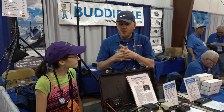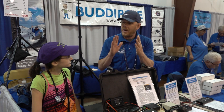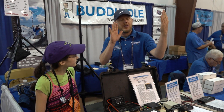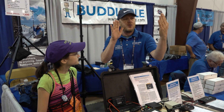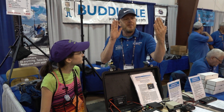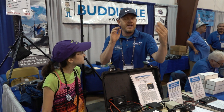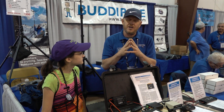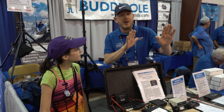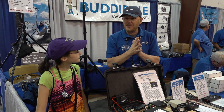We make Yagis, and the one I'd really like you guys to run down in the Dry Tortugas would be the vertical array. With one dipole you essentially have two verticals — either half of that dipole — and we set up a vertical array a quarter wavelength apart, on say 20 meters that's about 16 feet apart. The back one is parasitic — it's a reflector — and the front one is driven. This is an antenna that can be set up quickly, just a few pounds, and gives you gain similar to a two-element horizontal Yagi but without having to put it way up in the sky. You get a very low takeoff angle, and over the salt water it's tough to beat.